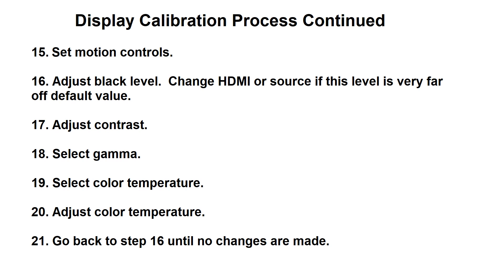At this point you'll start adjusting the display in more detail for the picture. You'll start out with adjusting the black level, then move on to the contrast and the gamma. The color temperature is adjusted last in this part of the process. Here we're going to focus on adjusting the color of white and the things that affect white, because white affects all the colors in an image. You need to get white as close as you can to start with before you move on to the more saturated colors.